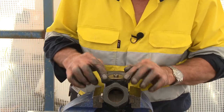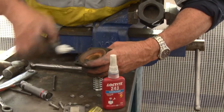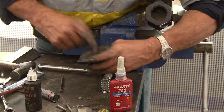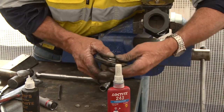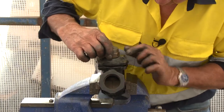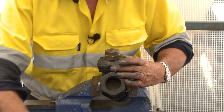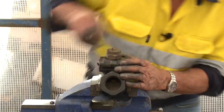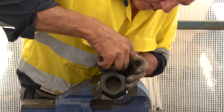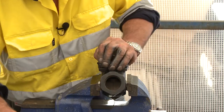Put the holes back over in the diaphragm that are already pre-cut. Don't forget your spring. There's nothing wrong with a bit of graphite dust in there - rub it into the pores of the corrosion. Believe me, it's not going to get any worse. Put the spring back in. Do you need lubrication on the spring? No. Put the spring on there, sit it over the nut, put the body in. Normally that fitting points to the front. Look at the spring resistance I'm fighting here - so you can imagine if I'd undone that big brass nut it would have been quite a challenge to get that back together without stripping the retaining nut for the spring. Sometimes you'll find that the hole in the diaphragm is not cut very well for your bolts to go through - there's nothing wrong with winding them through the diaphragm.